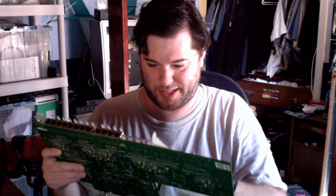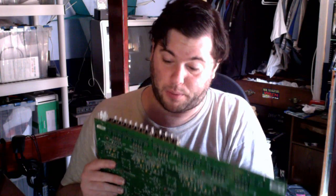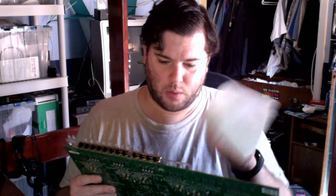Basically what's going on with this switch is when you turn it on, it gets stuck in a boot loop. It doesn't matter if you try a factory reset - you hold down the mode button when you turn it on and erase the NVRAM - it still complains about port 7 as some kind of loopback failure, and that's not allowing it to properly start up. This may not be fixable; it's likely toast anyway, but I have a new Cisco coming my way.